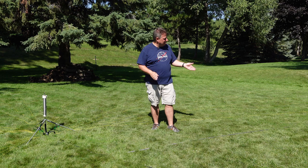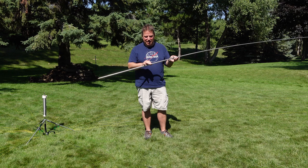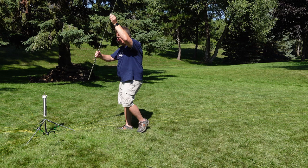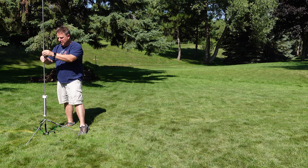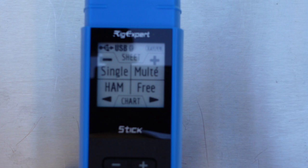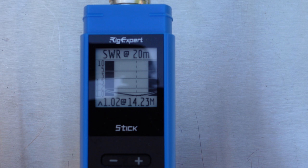Now we've measured the whip: 447 cm plus the 40 cm coil equals 487 centimeters. We can now put the whip up onto the coil. One thing worth pointing out — people complain about telescoping whips loosening up over time, and one of the worst things you can do is pick them up when fully extended, because bending on the joints is what loosens them. Put them on the coil first, then raise the antenna from there.